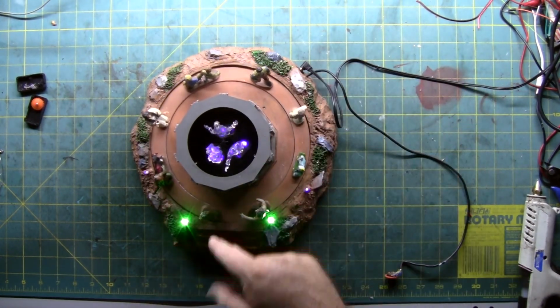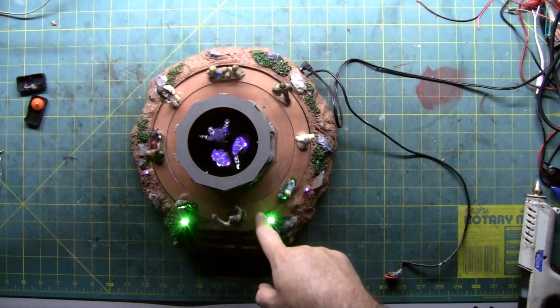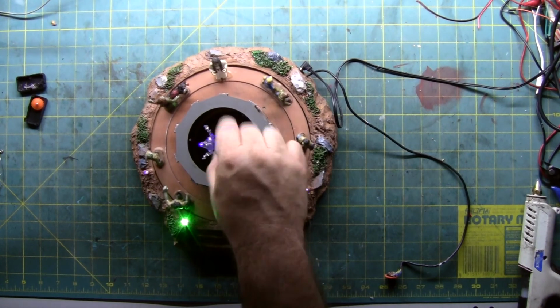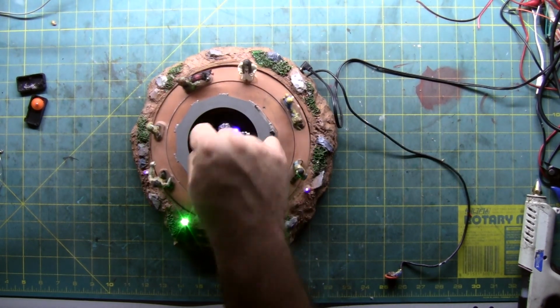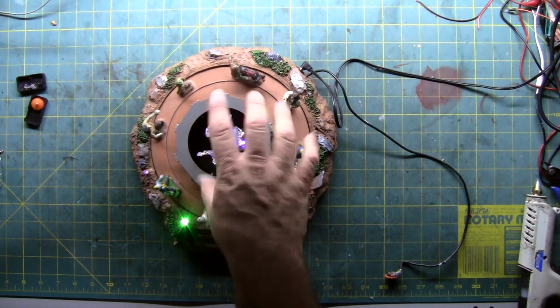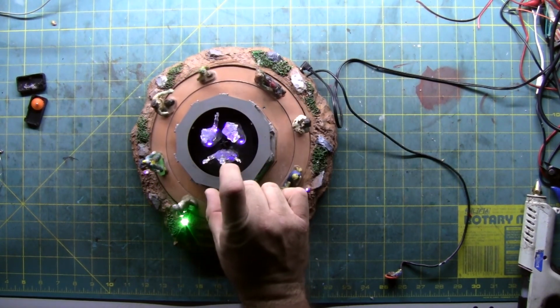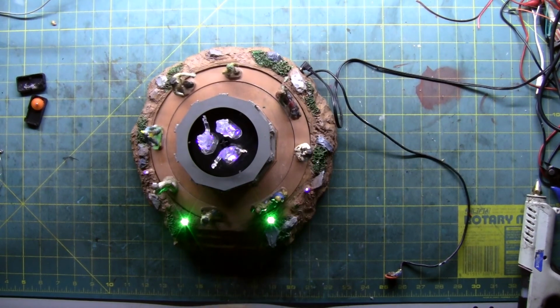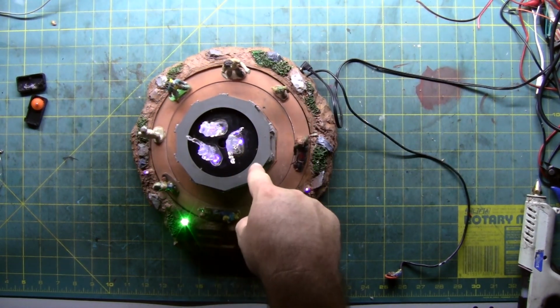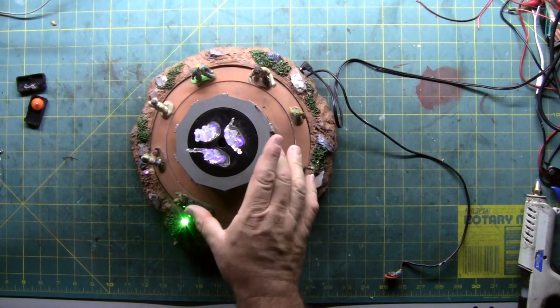Careful you don't break off an arm or something, because his arm sticks over the center base. Set it down, pop this off with the 3 characters, take out the 3 screws, which have the up and down motor mechanism. Then replace the belt. Just lift it off the 3 studs, or take that inner gear and set it aside again.